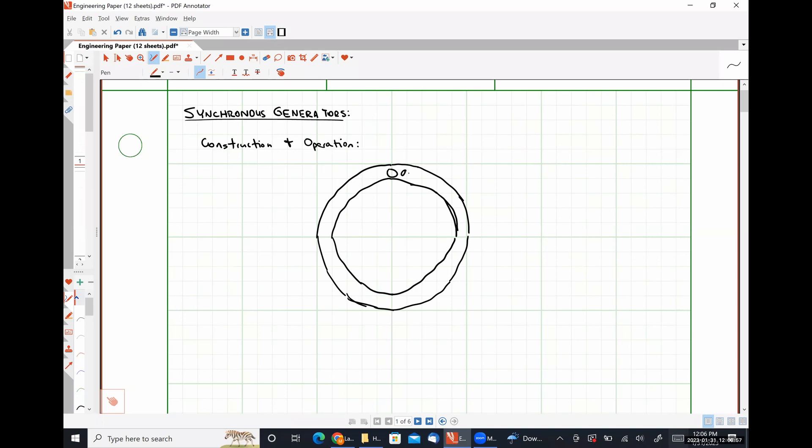So if this is our A, down here will be our A prime. 120 degrees out of phase with A should be B, and directly across should be B prime. 120 degrees out of phase with B will be C, and directly across will be C prime. These represent our phase windings, and this whole structure here is our stator.